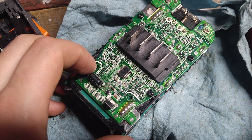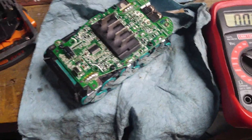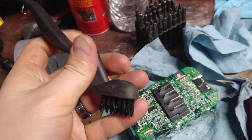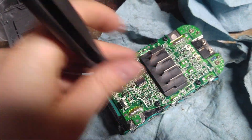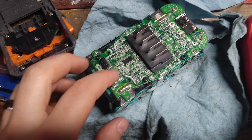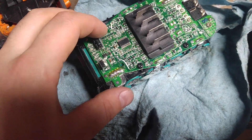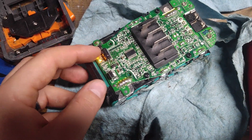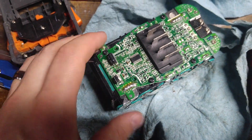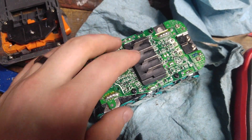On the one I found up here, there was a bunch of gunk on the board — a bunch of stuff all over it. If you take a brush — I used a nylon-tipped one because metal I think would hurt it — I scraped it all up and got the board to recognize that there was voltage there. When you press the button, only one light at the end would flash, even though I had 18 volts throughout.